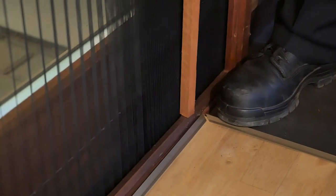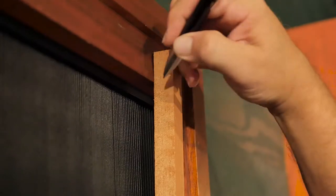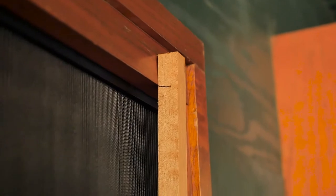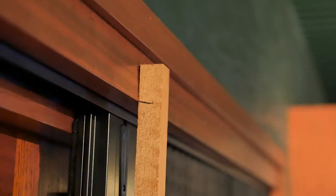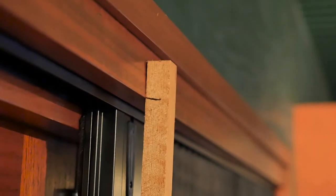This is how you use the stick for measuring. First, sit the stick on top of the sill, stand it up parallel with the jamb, and make a mark at the underside of the pelmet. Make your mark at the underside of your pelmet on your stick. Once you've done this, move to where the screen is actually binding and repeat the process. Once you've made your second mark, compare to see whether there's a difference.